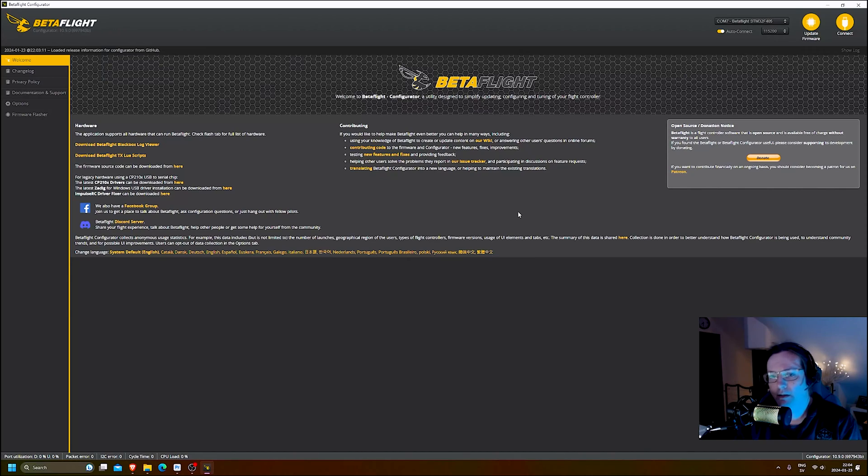After the activation and firmware update, turn off the drone, then connect the USB-C adapter that comes with the drone into the drone port and into your computer, and power it up with the battery too. You will need both sources of power to give the drone enough energy to turn on properly. Then download the Betaflight configurator from their homepage.